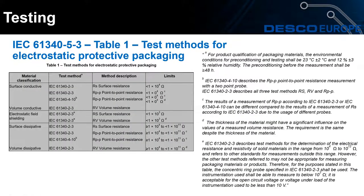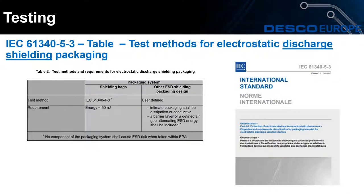There are different types of test methods and measurements for testing electrostatic protective packaging. A surface resistance test should be performed, a point-to-point resistance test should be carried out, and a volume resistance test as well. The test method for shielding bags is actually user defined, and Vaughn will be performing tests on shielding bags a little bit later on in this webinar.